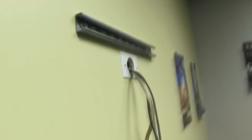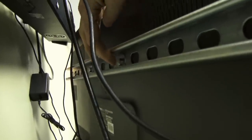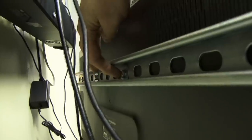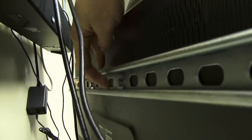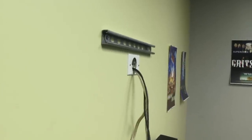Here on the back of the television is the same thing — this is the Unistrut back here. All you have to do is find the manufacturer holes, like these right here — this is where you would normally install one of the universal mounts. Use the same bolts that came with the TV, or take the bolt to the hardware store and get another one. You can see how it loops around and has like a J on both the top and the bottom. So these loop around and interlock with each other — there's really no way that's going to accidentally fall off.